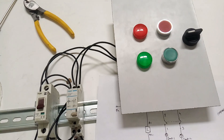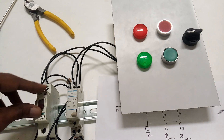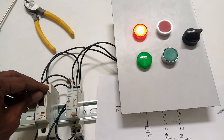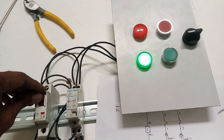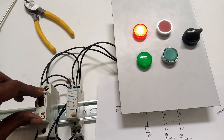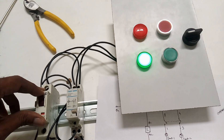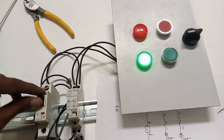For maintenance purposes also - if you have two machines you need to run them one by one. You need to remember today we ran this one, tomorrow we need to run that one; first one hour we run this one, second one hour we run that one. No need to memorize yourself - you can just fix this latching relay and it will do this work clearly, remembering which one ran before and which one needs to run next.